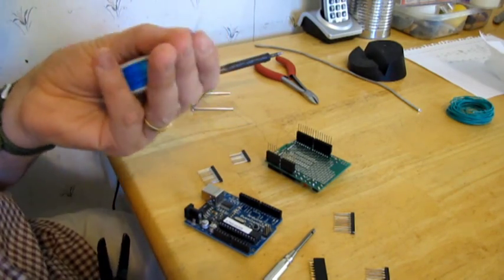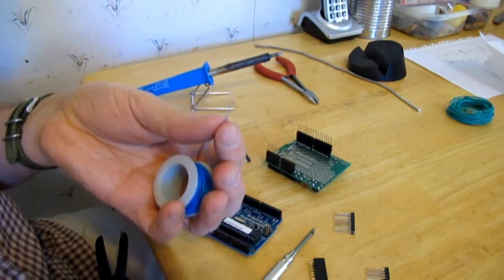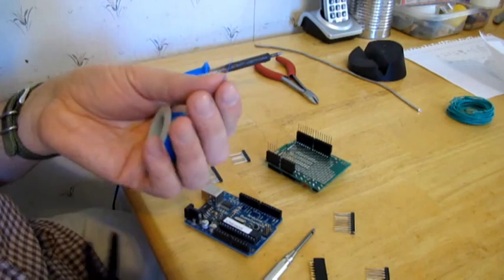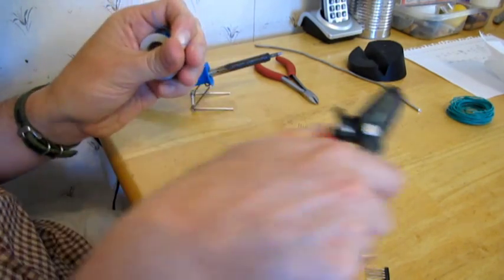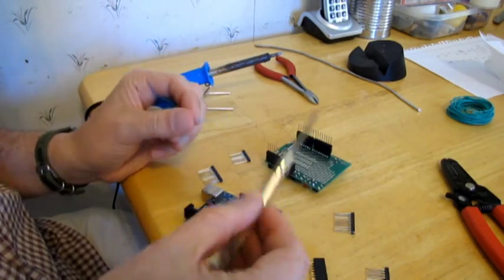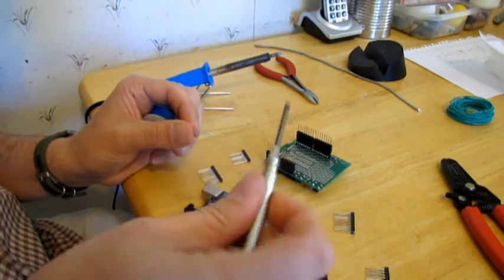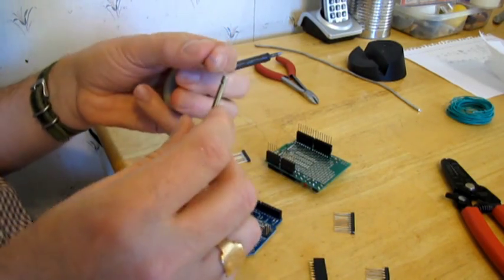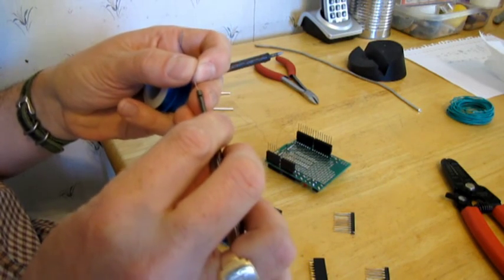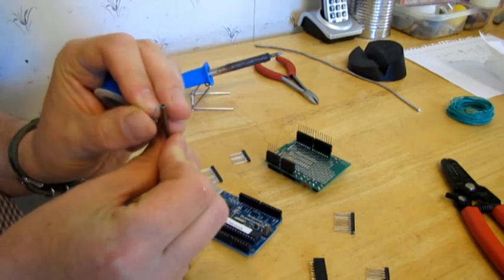So what you have is this very fine wire, and I'll have to look up and post what the dimensions of it are, but this is wire wrap wire. If you strip one end of it, then you have a tool, this little wire wrap tool. It looks a little bit like one of those eyeglass screwdrivers. But on the end, there's a hole, and there's a little teeny channel. And you put the wire wrap wire down that channel.